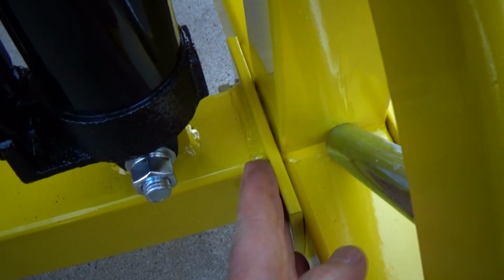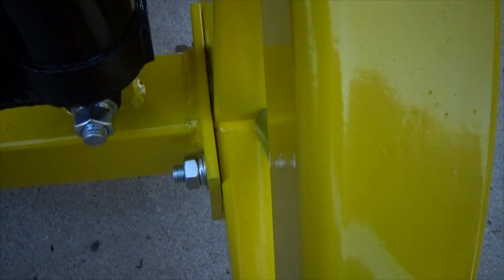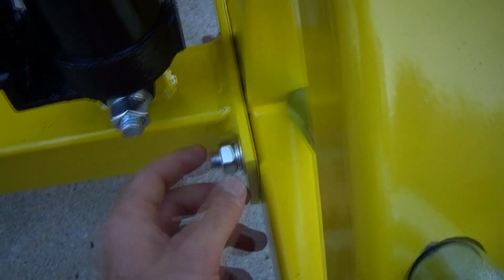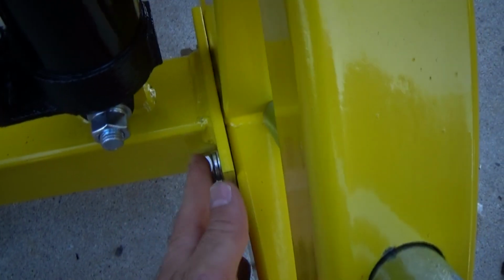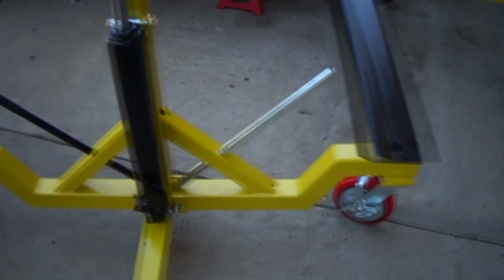And like I was telling you, when they welded this area right here, this thing actually kind of bent out on both sides, and that's just typical. I've been in welding situations before, so I know exactly what that's like. And so when I was tightening these two down, you could actually see a gap in here and over there, and so that 1/2 inch impact actually helped me draw those down to where they were pretty snug and now flat. So that was actually a good idea, I think, to use that impact, because if you don't get that flat, over the course of time it will relax and it will become loose.